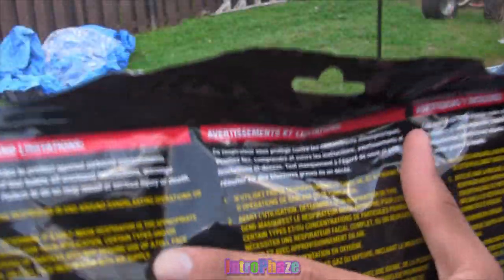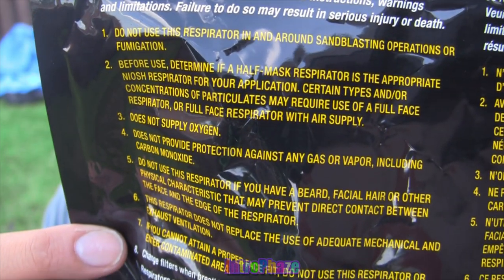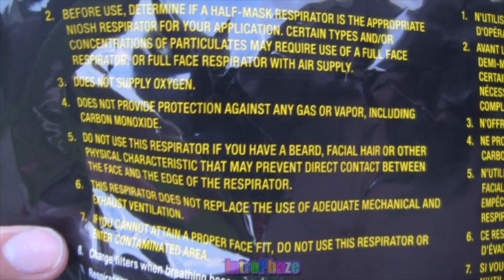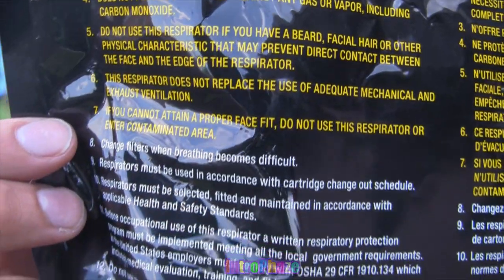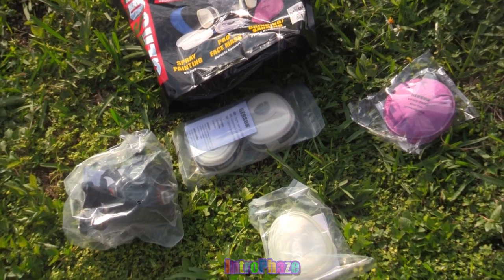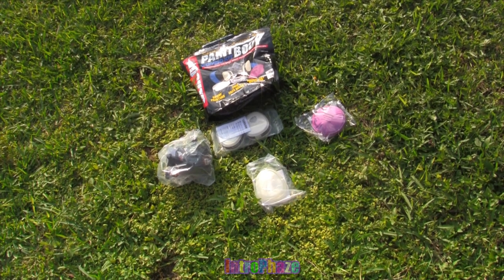The reason is multi-pronged. If you read the back of the labels, they say they only protect against certain fumes, certain materials, and certain welding wire. If all three of those aren't met, your mask is not going to work. On top of that, the masks don't fit your face correctly — everybody has a different shaped face, nose, mouth, and chin. What I discovered buying this mask just to demonstrate is that it doesn't cling to the face, so there are complete openings where fumes get into your mouth and nose. That's extremely dangerous.